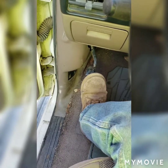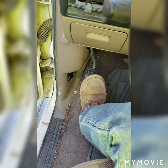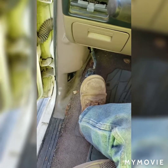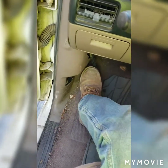When that 4,000-pound piece of equipment or bigger rolls up into that trailer and stops, it might make the truck lurch back and forth. That puts a lot of strain on your transmission, and believe it or not, they're really susceptible to breaking when they're in park. So it's always good to give that a good press.